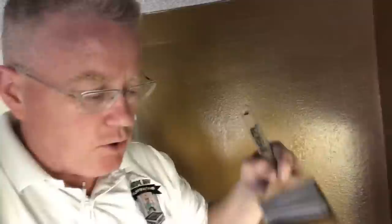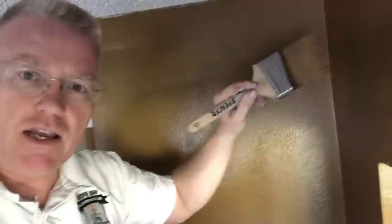This part is drying over here. When I touch this paint I can feel it pulling because the paint is starting to dry. Here's how you unify the wall — it's called keeping a wet edge. Put the brush back in the wet area, then pull it over here and lift the brush when it starts resisting. Pull from the wet edge toward the drying area — not onto it — and when you feel resistance, lift the brush.